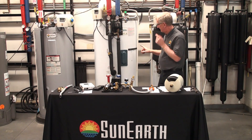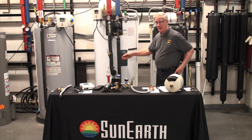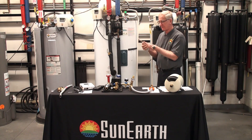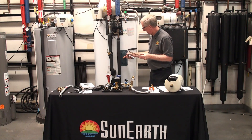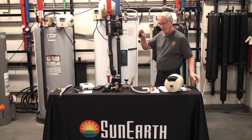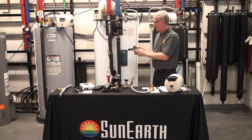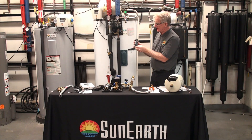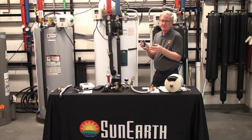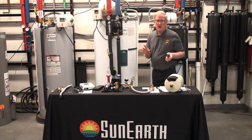The other thing with this Solar Ray AC system: it has an electric element and a thermostat — 240 volts. If this is your only water heater, it's an element immersed in the tank that screws in and seals, with a thermostat set in this access cover. You wire this to the 240 — that's an electrician's job. It goes from 110 to 170 degrees; usually you leave it at 130, though some people set it a little higher. No higher than 150 normally.